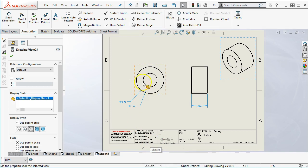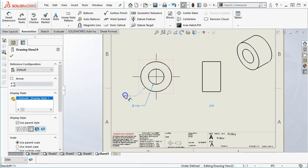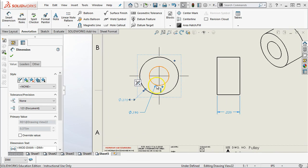All right, so cylindricity, circularity on this, probably at the outside, you know, whatever the stock material is at 3/8, I can probably live with. So if we were to go to even a 2 decimal place on the 375, that would be acceptable. The 190 through still has that issue with the 1032. We're basically creating a zero clearance fit if we do the stack up just right, and I get machine screws that are at 190, then putting it through a 190 hole, through a 190 spacer into a tapped hole, all of those holes have to be theoretically perfect.